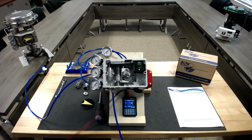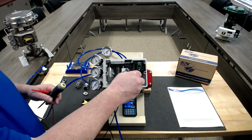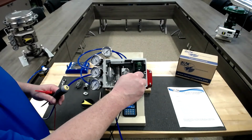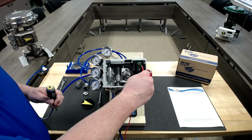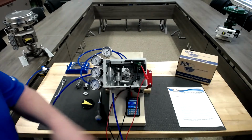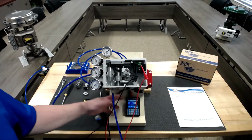Initially, in most cases in the field, you may not have the luxury of the control room working yet, or your shop. We're going to use, as we do here, a generator to generate a 4 to 20 signal. Right now, to calibrate the unit, we start at 4 milliamps.